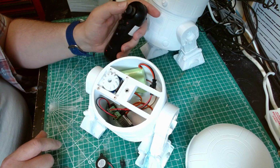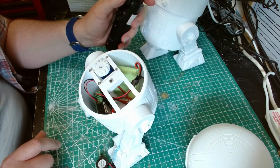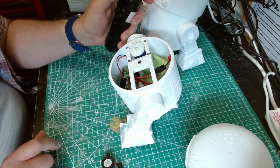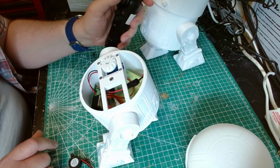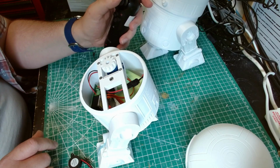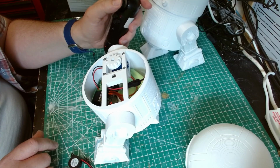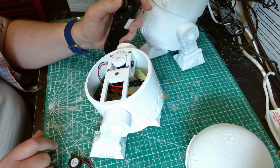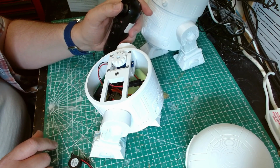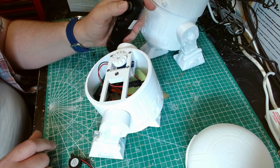and then for drive, oh, so that's working. I need to put a bit of dead band in there because that's picking it up as a move straight away. So I need to put a bit of a dead band in there. I'd probably put that in the mapping of the joystick and say if it's. Well, no, I can't because I'm doing minus 127 to 127. I'll have to work out how to put a dead band in there.